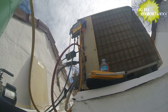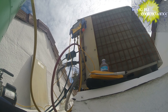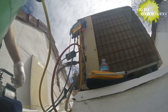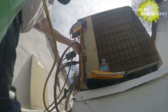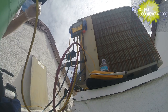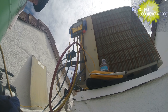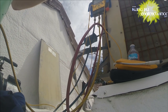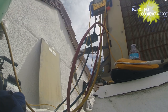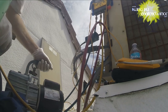Let's see, I need to change my yellow hose. Now, we've got it hooked up to the high side and the low side, and this is covering the Schrader valves. The nice thing about this is, close everything sealed here, and we pull a vacuum, we'll be able to tell if our leak is at our coil, or the unit, or somewhere else, or at the Schrader valves. The Schrader valves now are squeezed down and sealed,